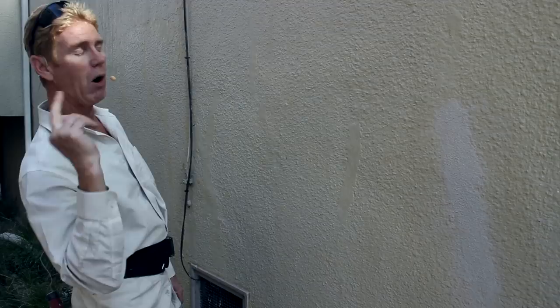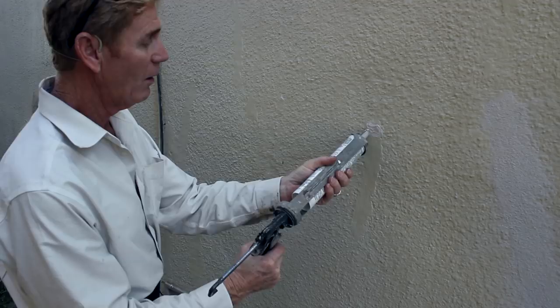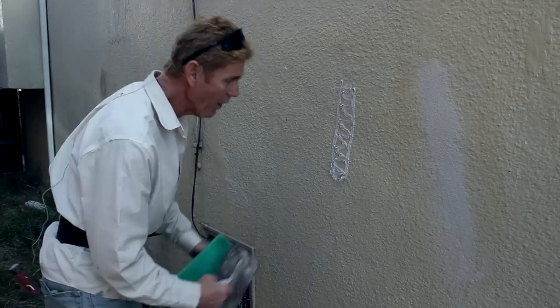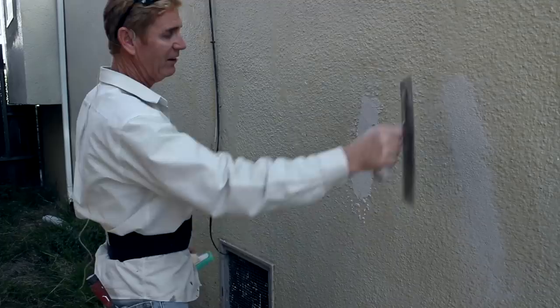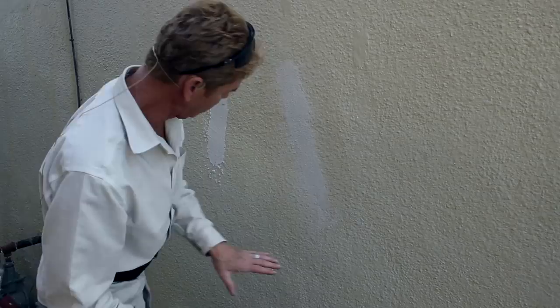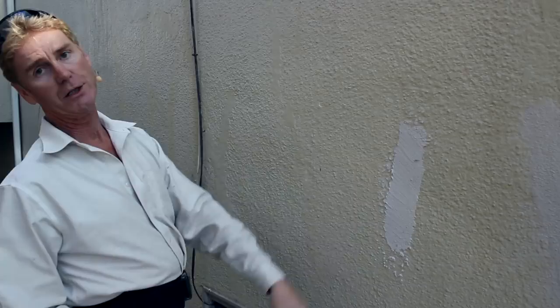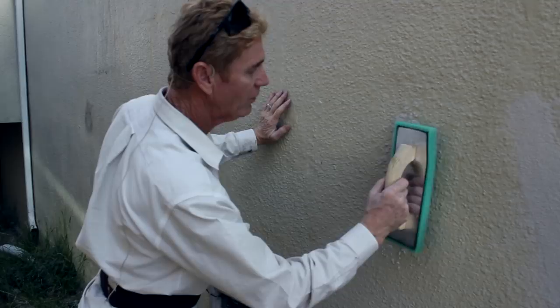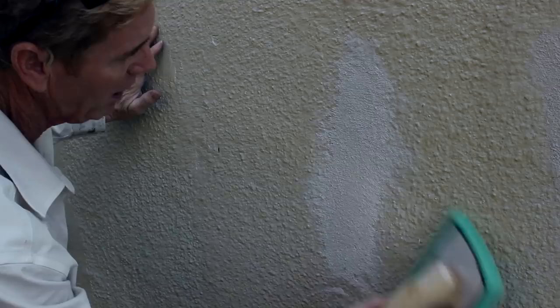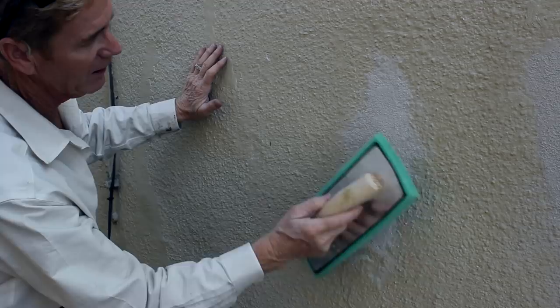What you do is take a tube of Moreflex - I've had it on the truck for about a couple weeks - and you want to give yourself a little bit of slack. Now this isn't going to match a dash finish perfectly, but he happened to like it a lot better than what he had. A dash finish is a thrown-on or blown-on finish. You put your caulking on it, then you trowel it. Then you take a sponge float - a green sponge float - you can have a little water on it and just hit it with your sponge float. The more water you put on, the more of that sand or aggregate you're going to bring out. Get a bucket of water and dip the float in often.